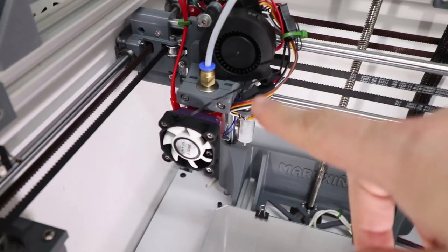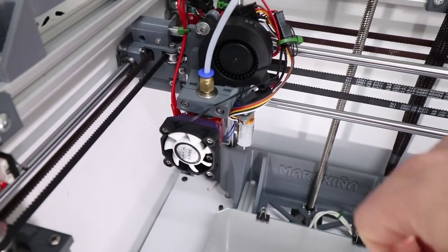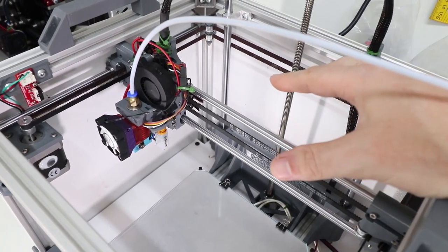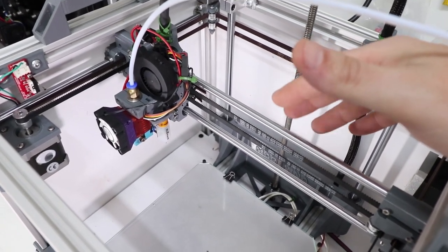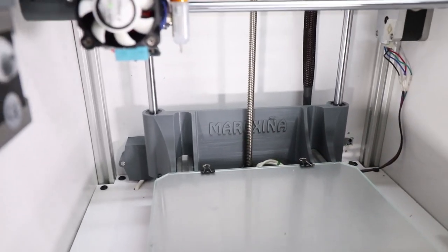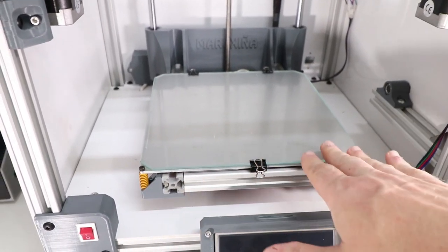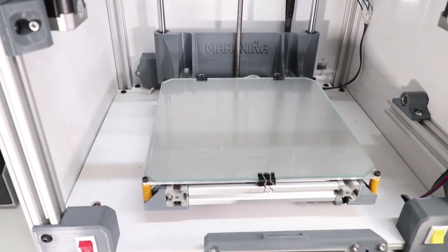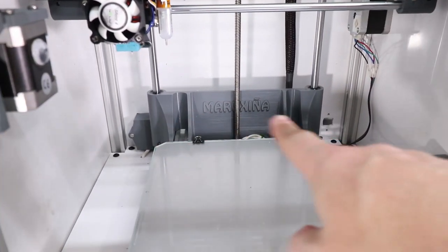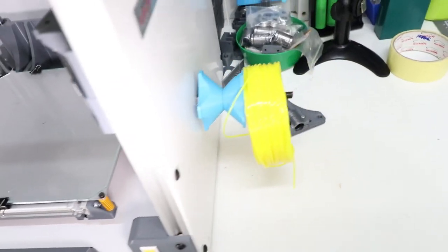The printer still has the original E3D V6 hotend with a silent fan and BLTouch. The most important hardware change was replacing the X-axis rods — previously 10mm rods, now 8mm — which saves a bit of weight and allows slightly freer movement. But what has influenced me most is the Z-axis bed support piece: the previous system had flex where the bed was not properly secured and could move more than 1.5 to 2mm, which was ruining my prints. So I designed this new piece with 10mm rods and LM10UU bearings.